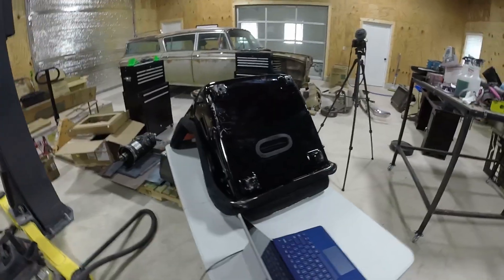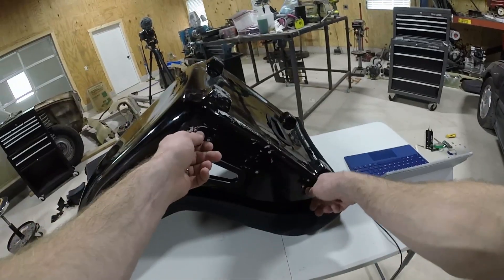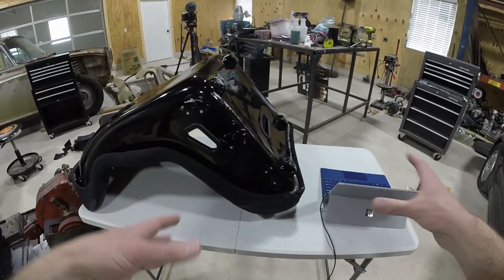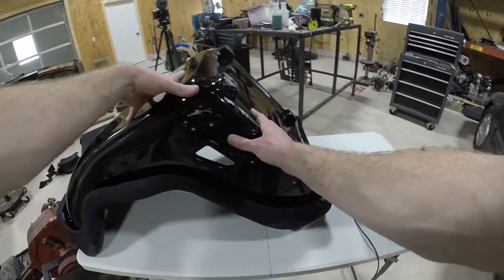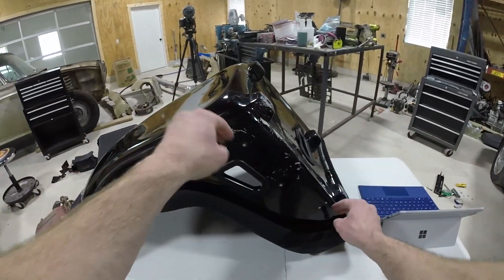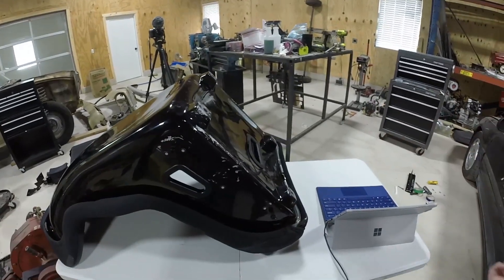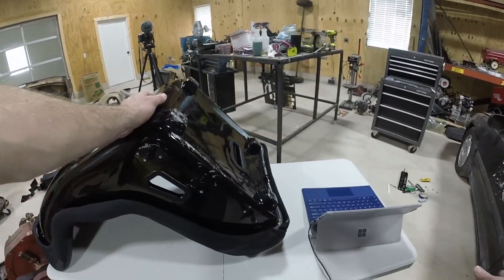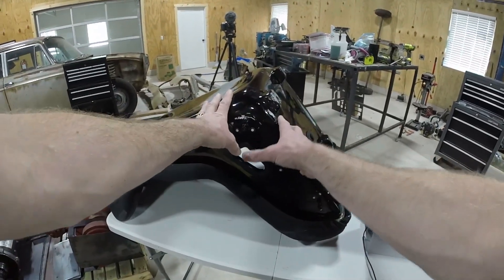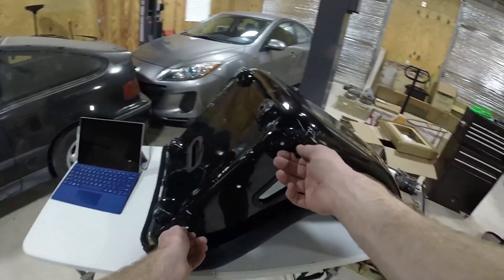The goal is to capture these four mounting holes. It's important that I stick to the original seat mount geometry. There are some racing regulations that keep me from making custom floor mounts. I'm going to tie these endpoints into the existing geometry, or the existing seat mount, so that I stay rule compliant and so that I can get the seat as low as possible in the car. So I'm going to start prepping these bolts.